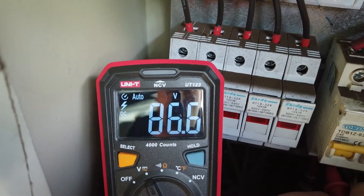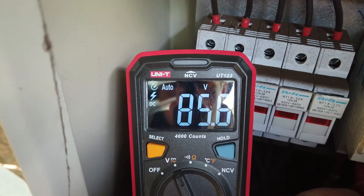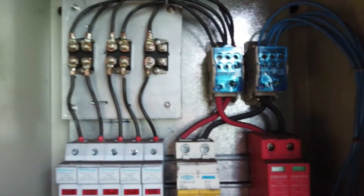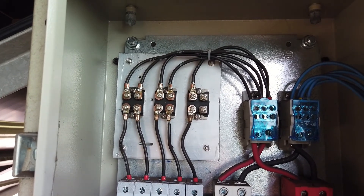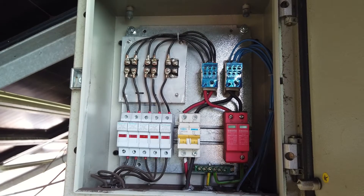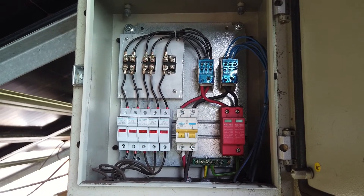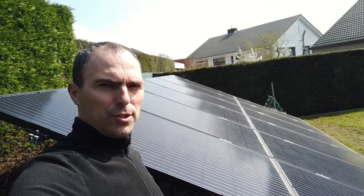Coming back on the voltage — 85 to 86 volts. We really need three panels in series; with only two panels that would be around 50–55 volts, which would not be enough to feed the solar charge controller to charge the batteries. So we definitely need three panels in series. Most commercial combiner boxes don't use anti-flow-back diodes — they're already inside the solar panels — but it's just an extra safety feature. I will make another combiner for the solar on the shed and record the whole process. The project description is on the website and the link is in the video description.